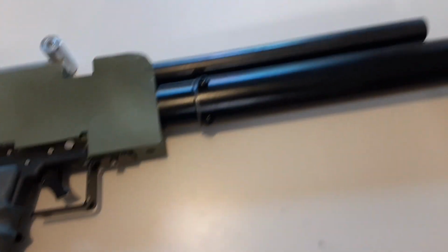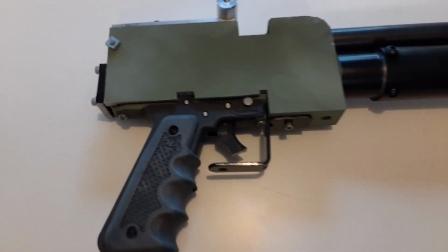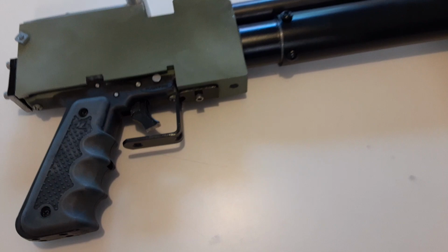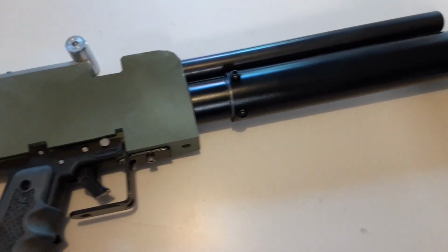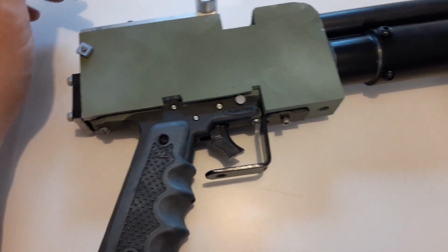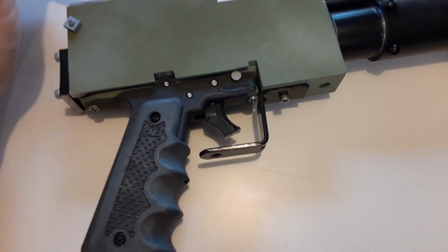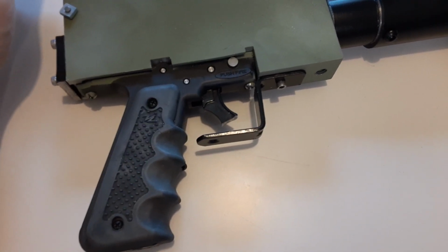But the Rogue, everybody had hand pumps at the time. These $200 Chinese compressors weren't around. So people quickly figured out, and I think Crosman put it out at the time, you could not fill with a hand pump because you needed that air pressure to seat the valve. You needed an instant burst from a tank to seat the valve. So that killed a huge part of the market share, because of the tanks and the filling equipment and going to the scuba shop. There was probably only a small percentage of the forums using tanks at the time. Maybe not a small percentage, maybe 30% had tanks and all the equipment and everything else.